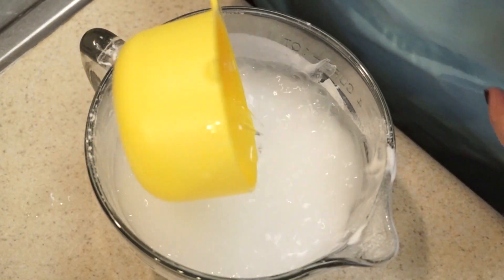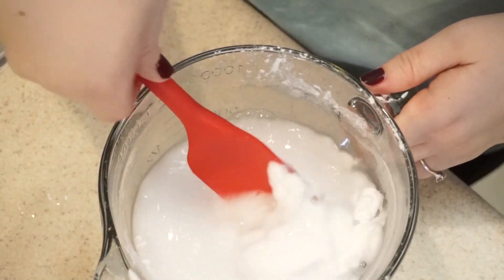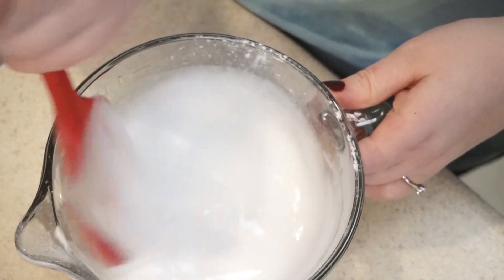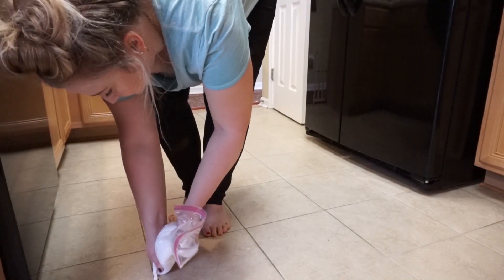Let's move on to the second half of my kitchen. This time I'm going to make the solution just a little bit thicker to make it easier for piping — closer to a toothpaste consistency, but still slightly wetter than that. I'm just piping that into the grout lines again, and as you can see it's a little bit easier now that it's thicker.